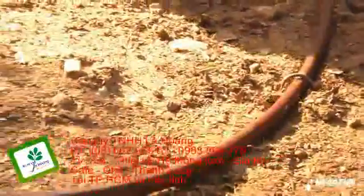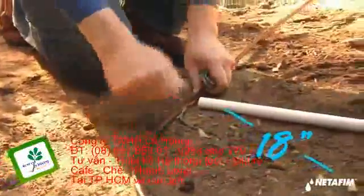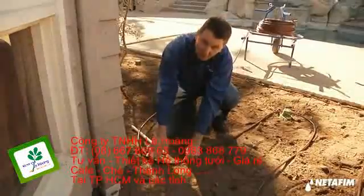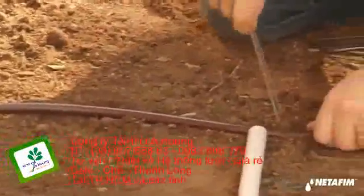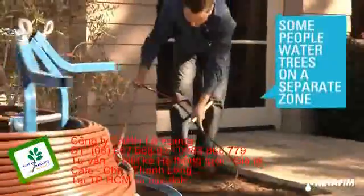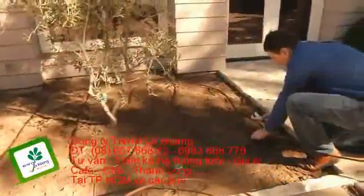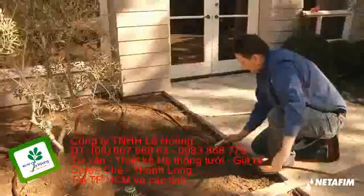And now we're actually going to make another turn — some people call it snaking it. We also have this piece of PVC pipe cut to the right width so we know how to space our tubing. There's a foundation here at the house, so we'll keep our dripper line a little bit away from the foundation. The other nice thing about drip is you don't get spray on the siding, which can do property damage where you have to replace it over time. This will all be covered with mulch — you won't see any of your irrigation like you would typically with a spray head. We're just trying to keep a continuous loop. When we're doing a loop or snake layout like this, we always want to loop it all the way around back to our stub up. You can see we're not using very many fittings on this whole planter bed — it's less expensive and also less labor.